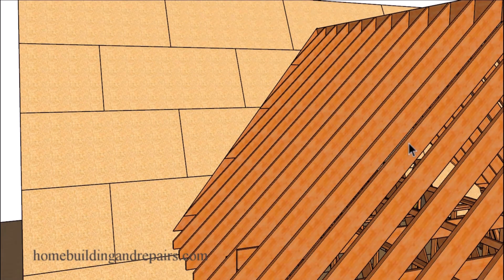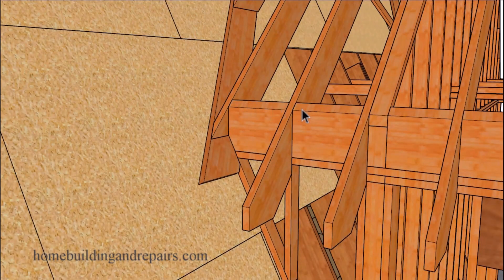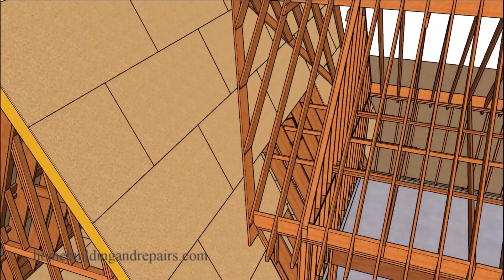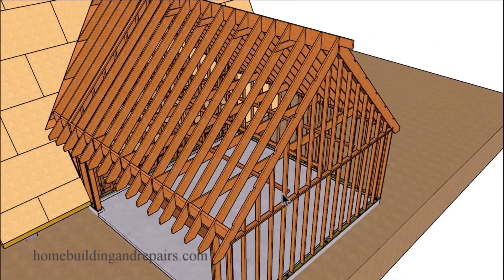Let's head over to the other side to see how the sheathing is going to connect in and run straight through. Since this is a 45-degree angle, you could shape the top of the ridge — that's not too difficult. The rafters will blend in and create a flat surface through the fill area, and our blocks will have their tops shaped as well, which is not difficult at a 45-degree angle but would be difficult for steeper pitches. This wall here will be our firewall — we need a firewall to separate the garage from the living area, and if you're putting a door from the garage into the living area, you'll need a fire-rated door.